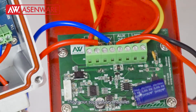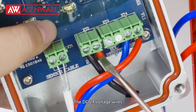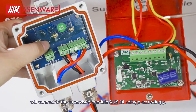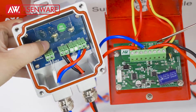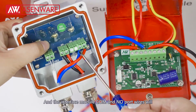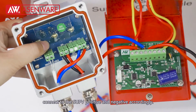This is our supervisory module. The DC24 voltage wires will connect to the supervisory box 24 voltage accordingly. And the interface module COM and NO port wires will connect to SUPV positive and negative accordingly.